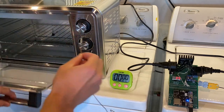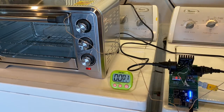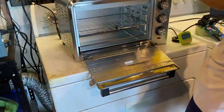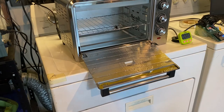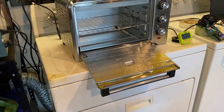Now let me put my probe into the oven to start this process. I used the oven for some video just now, so the temperature jumped to 50 degrees. I pressed the button and the automatic closed-loop control started to follow the profile. As you can probably tell from the video, the temperature didn't quite catch up — it did not reach the target value I programmed. I figured there might be strong heat leak through the glass door, as I felt pretty strong radiation right in front of the oven. So I decided to seal it up with foil tape to reflect the radiation back into the oven. I left a small window just for observation. Now it looks not as nice as before, but it should work better.